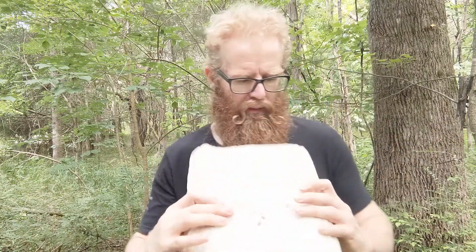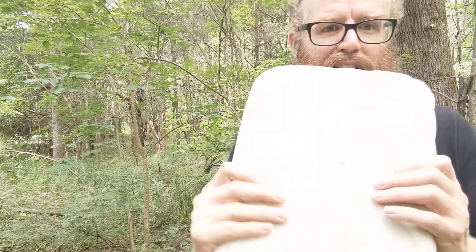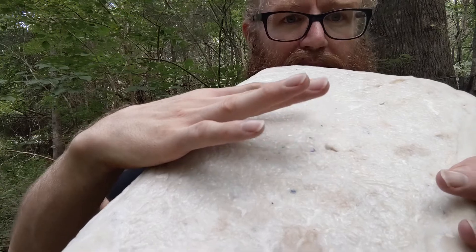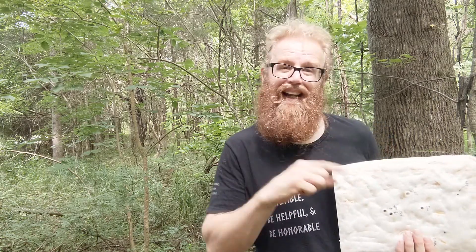I've noticed the two 9mm holes here — this one penetrated about an inch, this one about an inch and a half, which are very interesting results. Looking at the back, it actually delaminated a little bit, meaning the plastic didn't fully adhere to itself — it melted but didn't really bond to the plastic around it. And if you cut the bottom piece off, you can see voids and little pockets where the plastic isn't supporting itself — very concerning. Reflecting on the manufacturing process, I could have heated the plastic more to get better liquid adhesion, or kneaded it more effectively. Next time I'll heat it and knead it more thoroughly, then press it in a much more substantial form to get those voids out.